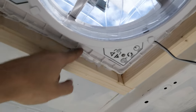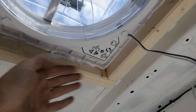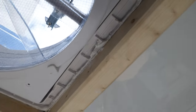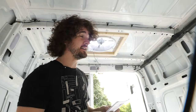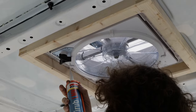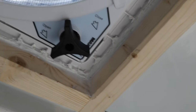The screws were a bit fiddly but went in. One thing I noticed was sealant squeezing out into the interior — it won't be seen unless the cladding comes off, but I'd do that step later in the process next time. I also noticed one of the screws was located right above the circuit board of the fan. It doesn't say to do this in the instructions, but for insurance I removed each of those screws and put a little bit of sealant behind each one before replacing them.